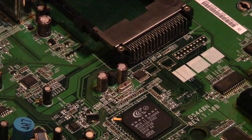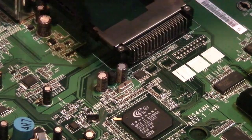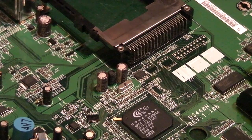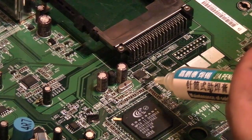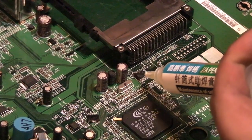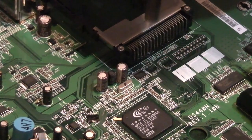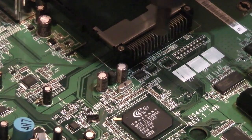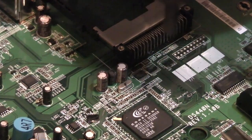There. But yeah, I'll show you one more seeing I messed that one up, but it's basically the technique that I use when I want to take stuff off these multi-layer boards. It's all down really to warming it up before you start. Get your flux in there. Your flux, like I said, is one of the best things.